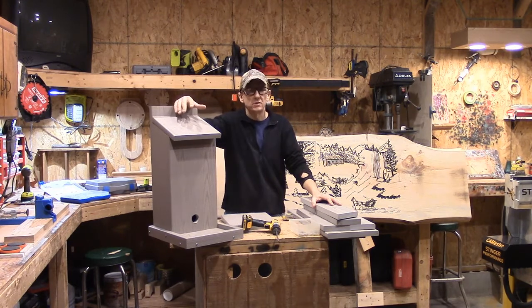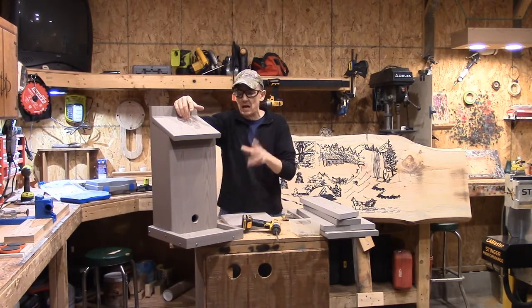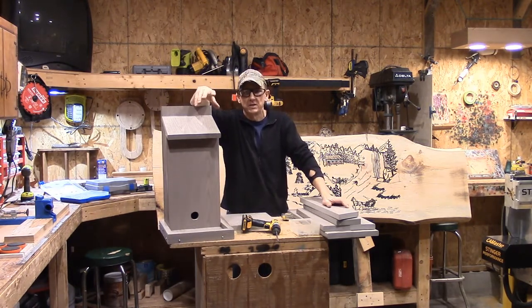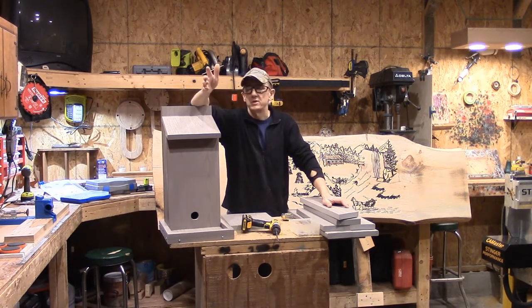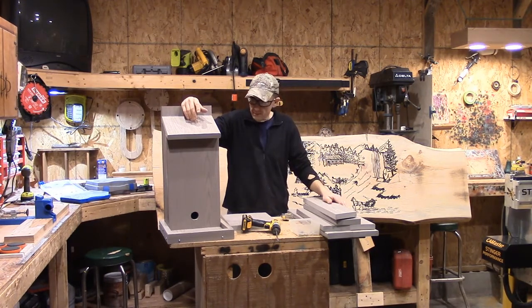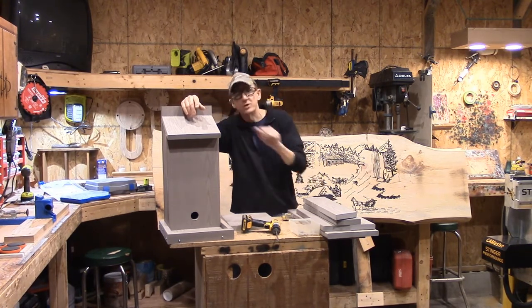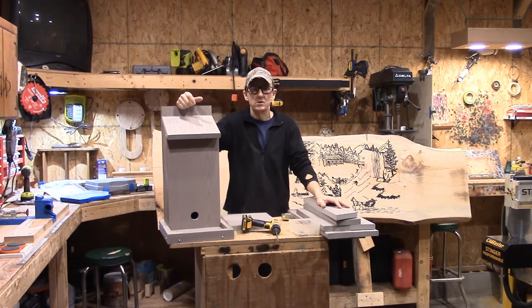These are great assets to your yard. We're going to give you a small piece on this as to how to put in a small engraving on the front. I'm going to go into CAM software real quick and show you basically how to figure it in, how to set your panel in the machine. I would not suggest engraving composite — I've done it. Silhouettes are okay, but don't try to put a high depth detail engraving in there, it just doesn't look right. The last part of this, we'll pull you into VCarve Pro and show you how to figure out where to drop in an engraving, if you chose to put one in there.